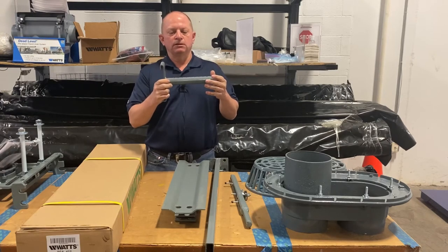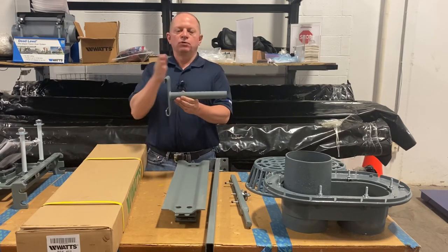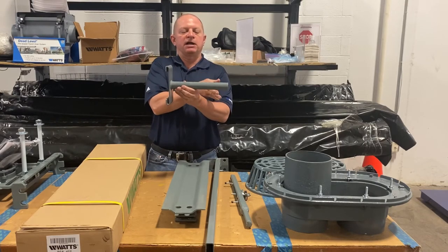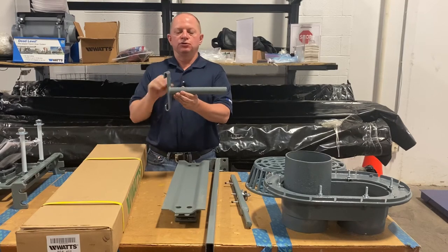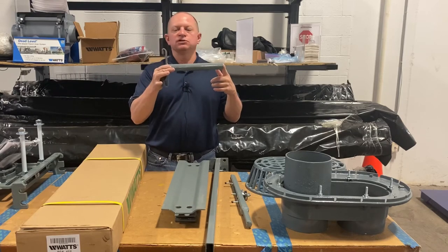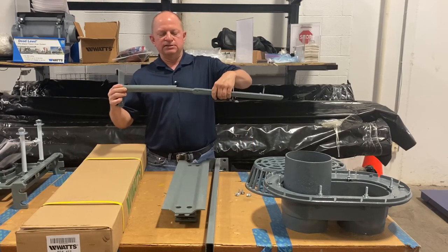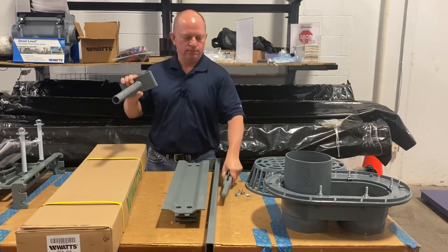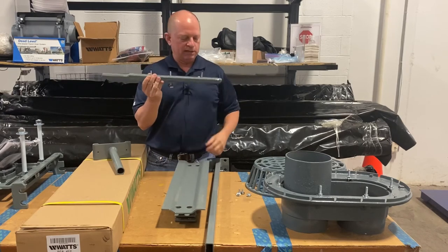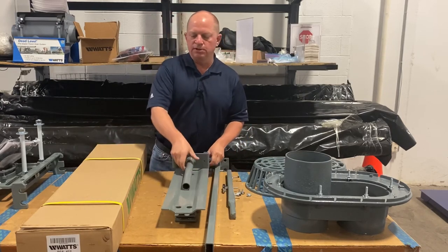These sleeves are 10 inches long, so you don't have to worry about extensions. When the finished wall goes up, on most lavatories you just cut this off about an inch and a half past the finished wall. You don't have to worry about having a thick chase requiring extensions — this has been designed to go through an 8-inch block wall right out of the box. Then the arm simply slides in and is locked in place with two set screws, and you've got your two leveling screws and a locking device.